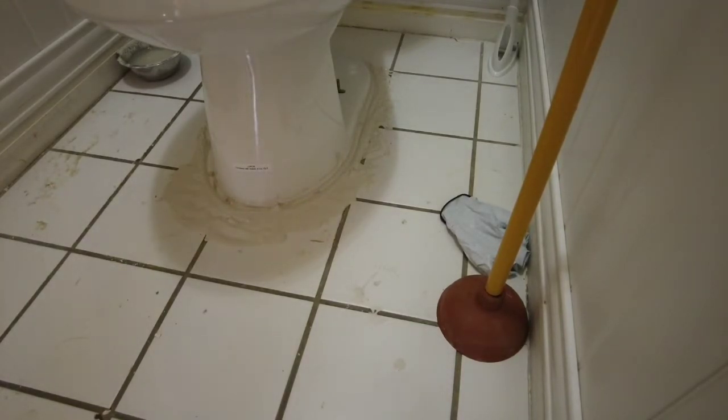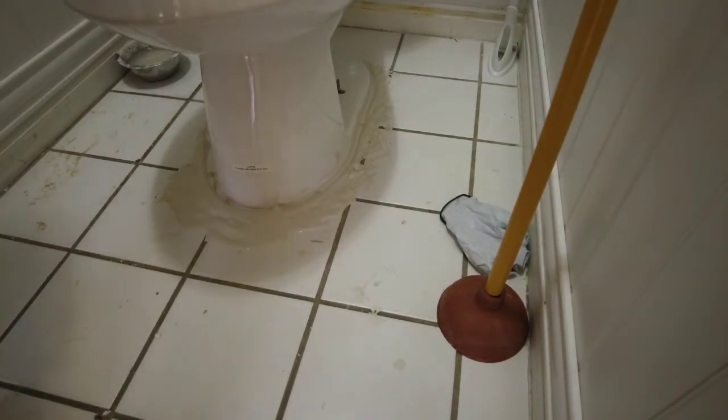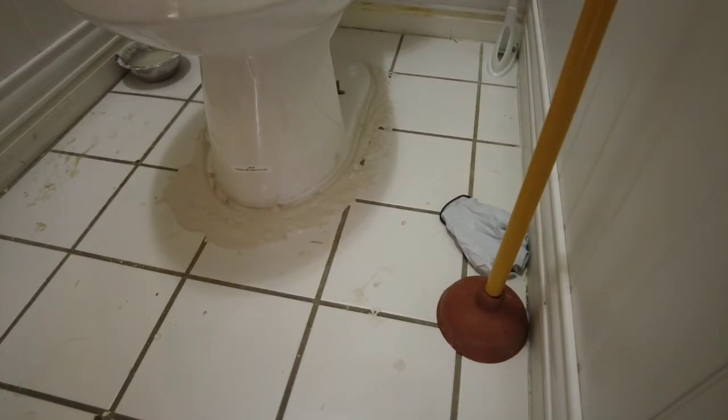Like I said, I find it easier to just let that dry on there and just chip it off. And I'm probably going to go ahead and do that. That way I have less residual there too. But a lot of people, if you want, you can just clean it all off. But make sure you don't clean it off before you tighten down the bolts here, because what you end up doing is pushing most of the plaster inside and leaving it unsealed on the edges there. Alright, so let me just lock these bolts down.